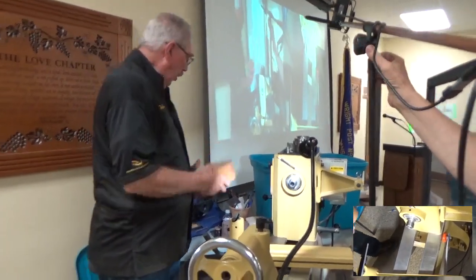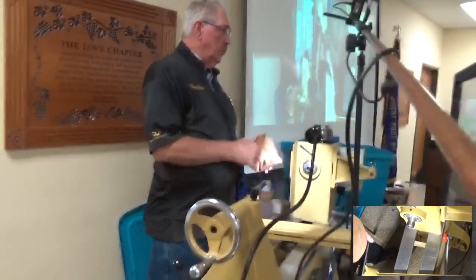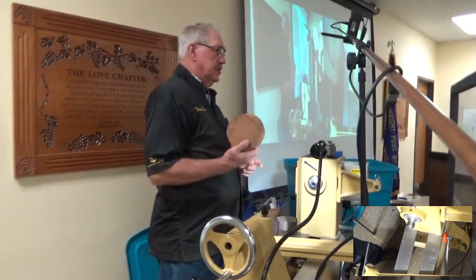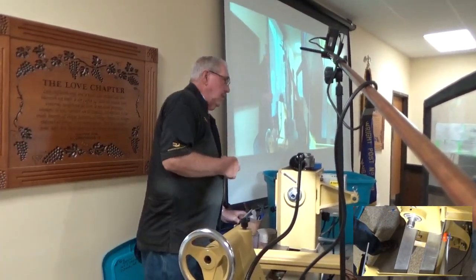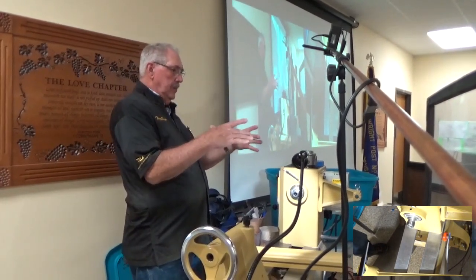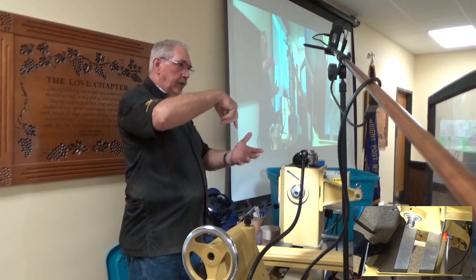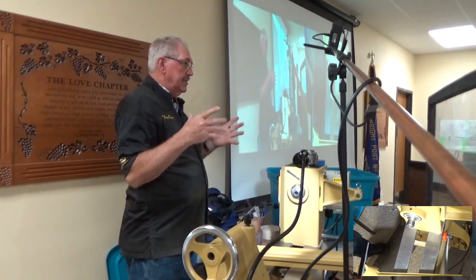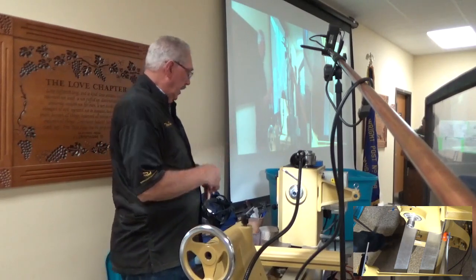All right, we're going to turn a bowl tonight. First thing you want to do is select your wood. And of course, most of you already know, you cut a tree down, you don't just cut a slice out of there and use that for a bowl, because you've got the pith in the middle of the tree, and that's going to crack because your wood's going to shrink more on the outside than it does on the inside.